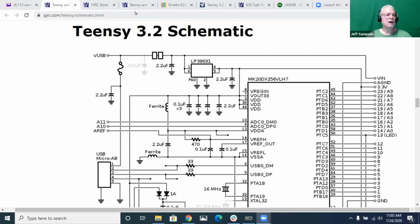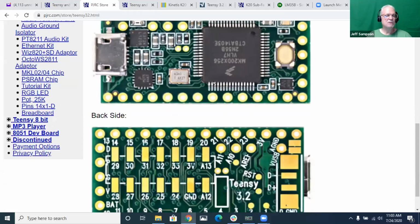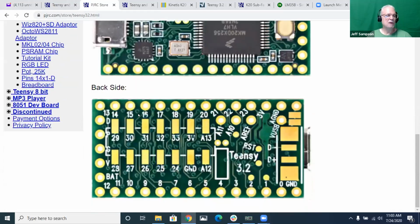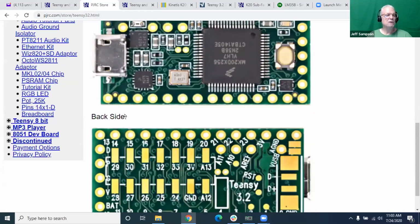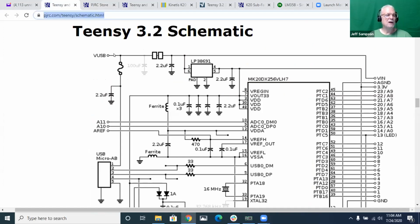And if you go look at, I think it was this one. Right here, this hole on the back is called VUSB, and then on the front, it comes through right here. So that pin is available to you. But if we follow that some more, after that pin it comes from this weird looking thing here, which turns out to be a jumper block, and that is on board. That's this thing right here.